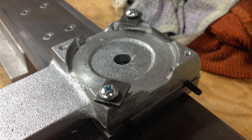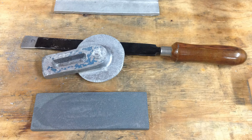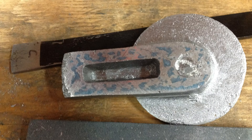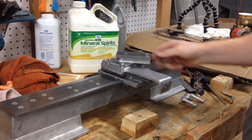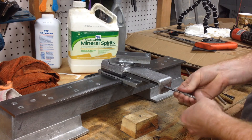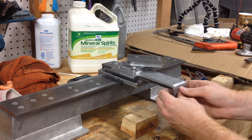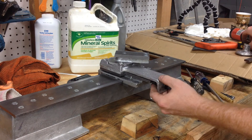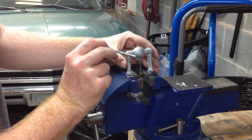The steel rod cast into the cross slide was driven out. The empty hole facilitates attachment of the compound swivel base. The steel rod cast into the compound remains and serves as the pivot for rotation. The compound swivel base is cleaned up and scraped similarly to the carriage. The compound ways are mounted on top. It is important that the feed screw drive holes are well aligned with the voids in the carriage and the compound swivel base. I cast several ball handles with steel arbors. Even though I coated them with soot, they would not be driven out. Drilling a pilot hole slightly smaller than the arbor diameter enabled me to drive the arbor out.